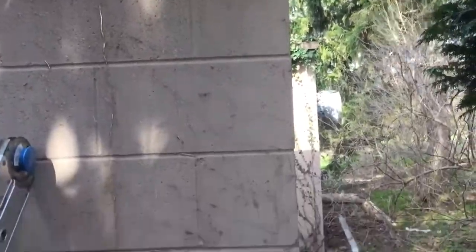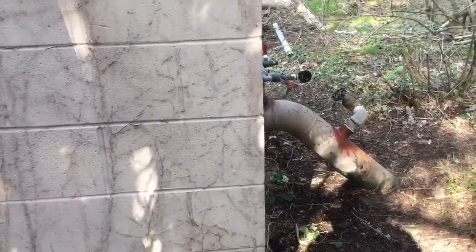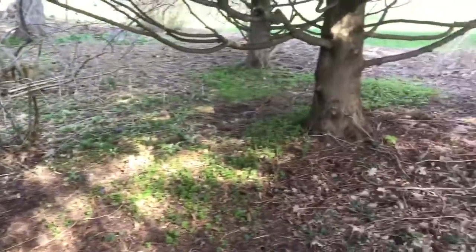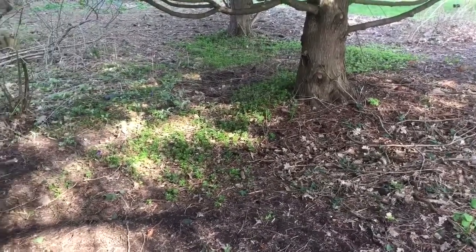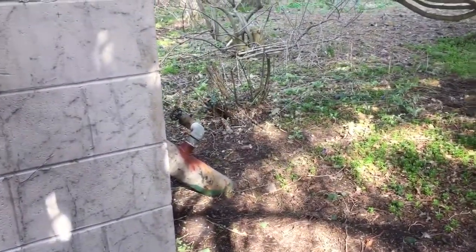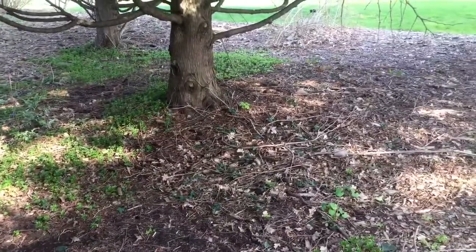And what that's gonna allow me to do is put a strap. X marks the spot right there. So we'll have one tie strap. We go down a few more feet, not too far because the ground behind us is a lot higher. So we're gonna stay up probably 3 feet and then have the second piece of pipe drain away from the building to the back here.